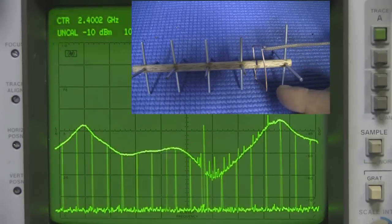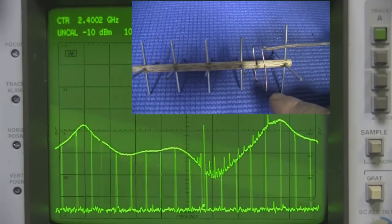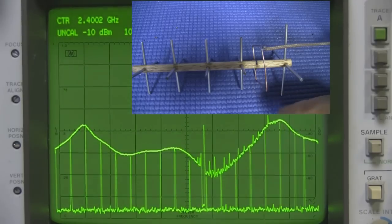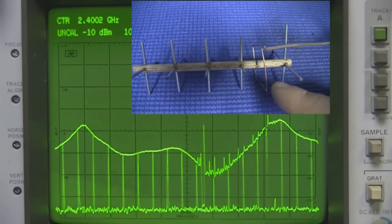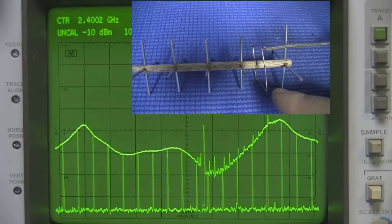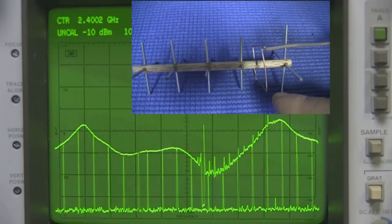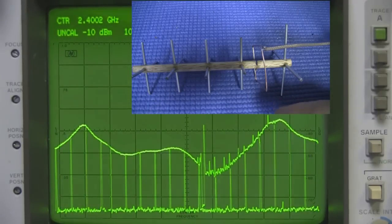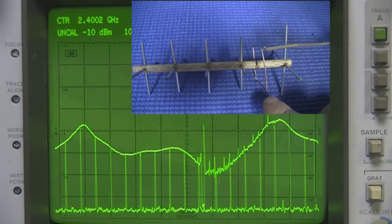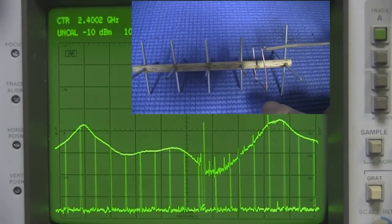I've been trying to perfect the X-Wing Yagi antenna further than I had previously. I've got the main driven element here — it's slightly shorter than the standard quarter wavelength, and I've gone with a square-shaped one rather than a round one, getting a much better response with the square. The quarter wavelength I've used for the driven element is 30.5 millimeters — very similar to what I use for a cantenna. I want to show how the position of the driven element along the boom can affect the frequency response of the Yagi, and it affects it much more than I expected.